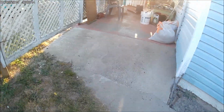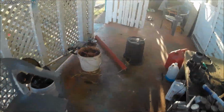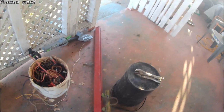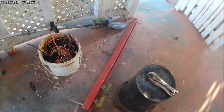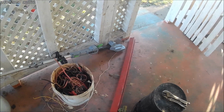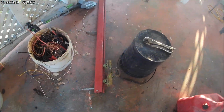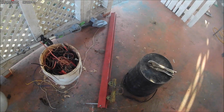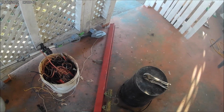Anyway, I had this beam up here on the porch when I had this concoction across here. All it is is a barn door track and a set of these little things. So at some point I got 3 chain hoists, but they're all the manual kind. Being lazy like I am, I'd rather have an electric one. But I'm not going to put a regular winch because they don't have any holding power. If something breaks, that thing comes down at a high rate of speed. Anyway, tomorrow we'll finish up this thing.